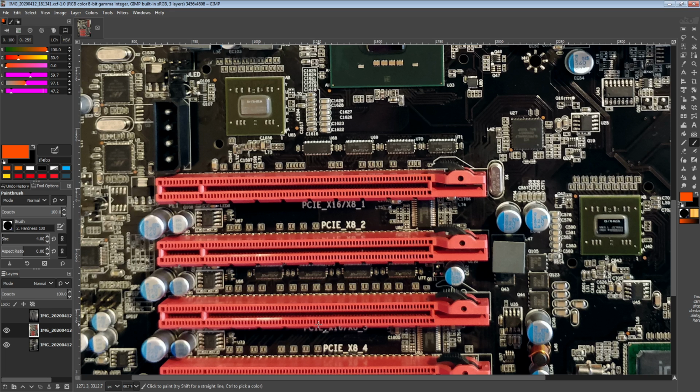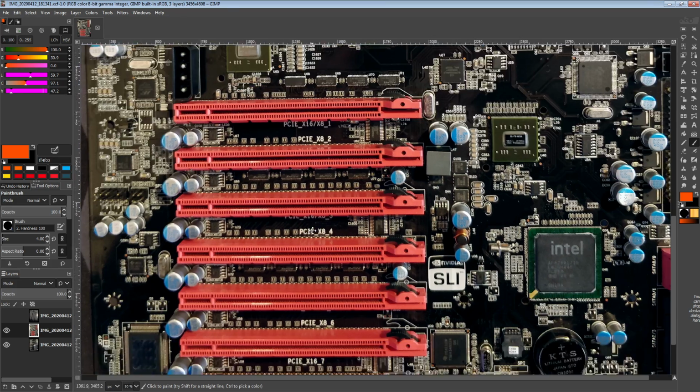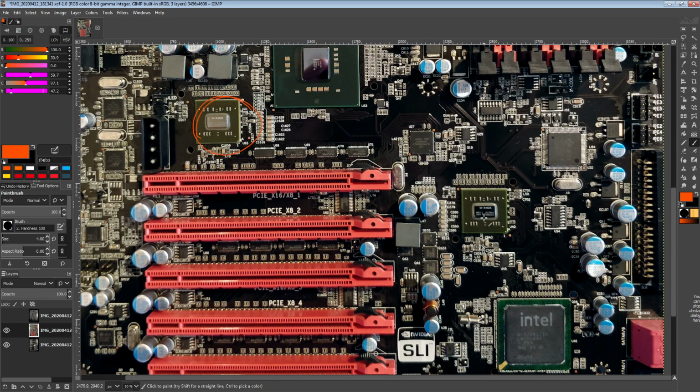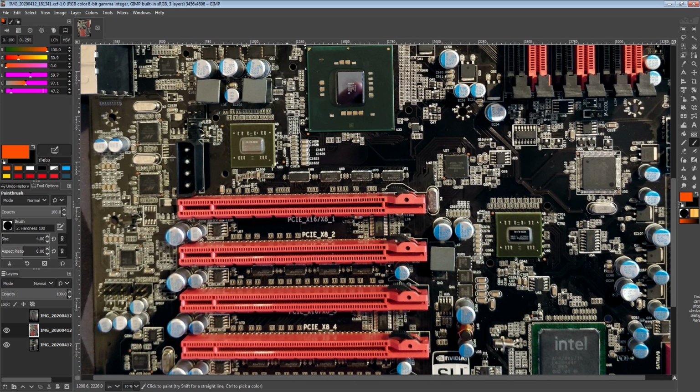Now, obviously, PCIe switches do not increase your bandwidth. They just make the allocation of the existing bandwidth more flexible. So the thing is, I bought the motherboard because I think it's cool, not because I think this is actually a good feature. It's just that there's not really many X58 motherboards that are bigger than this. So, yeah.